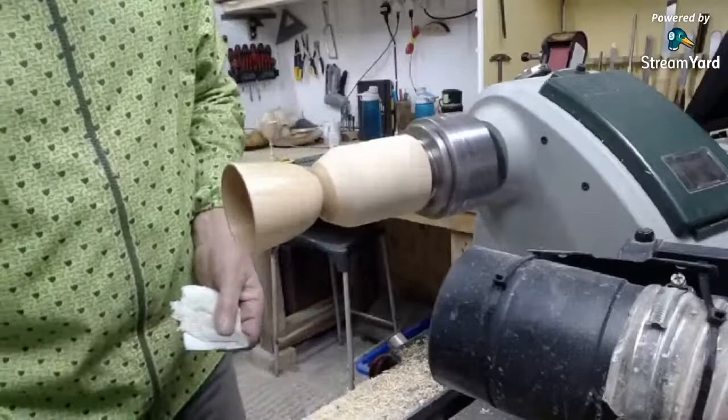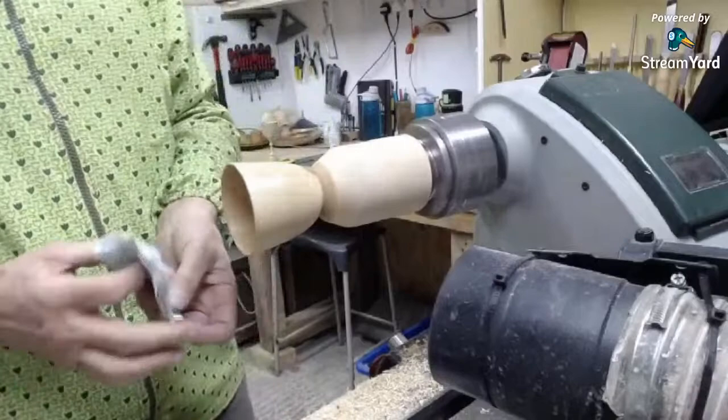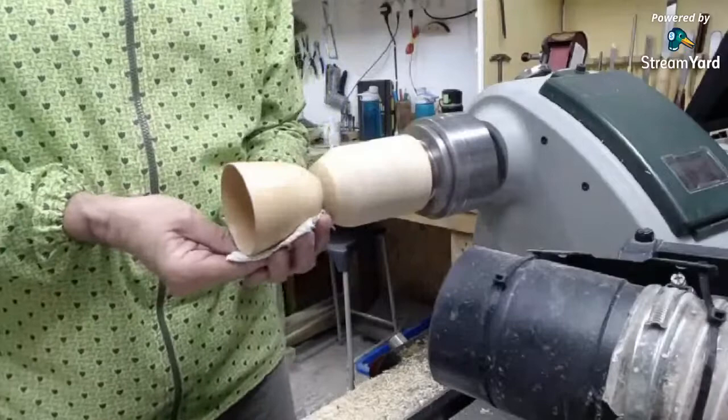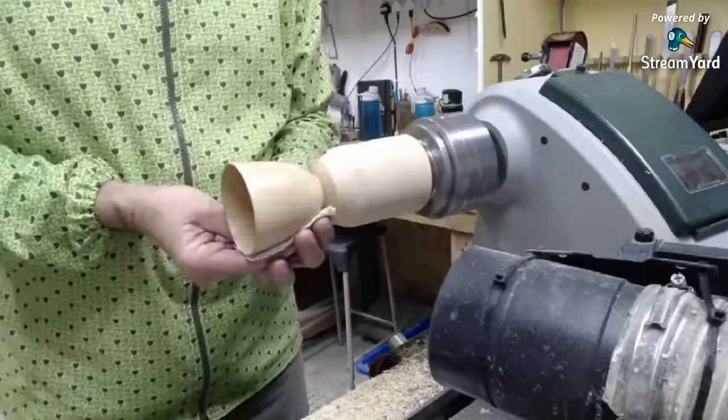His suggestion to me was, when you use Yorkshire Grit, put plenty on, but use enough. Then keep the same piece of cloth and stay on it for 3 minutes. I know the figures might be wrong here, but the grit that's in it is at 70 microns, I think that's what he said. And then as you're working it, it'll actually degrade and go down to about 10 microns.